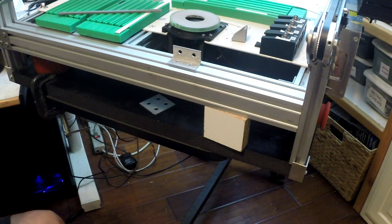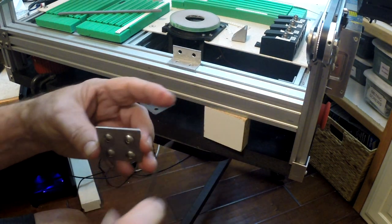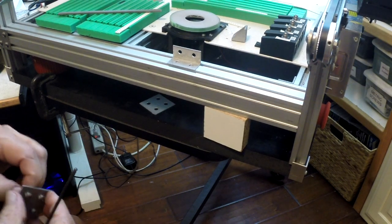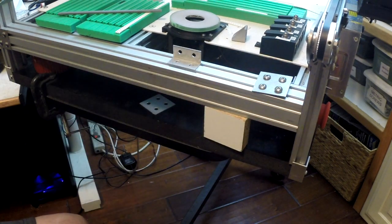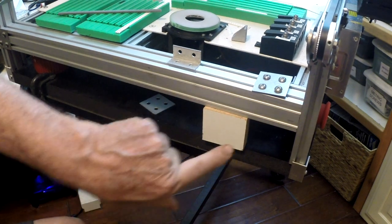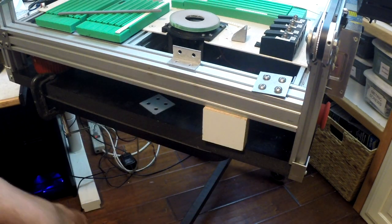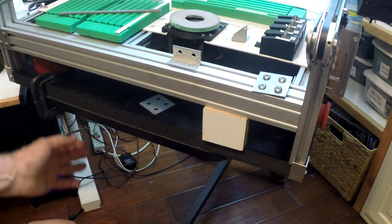And when I first got them, I did not like them, but after a while you learn how to push and turn, and they'll go in there and latch very well, and it makes for assembly nice and fast. I think any builder would know this hint: cut a bunch of blocks the exact height you want, and I put that under the whole frame, put these plates on, and within an hour I had a nice, perfectly flat, square frame, and I haven't touched it since then.